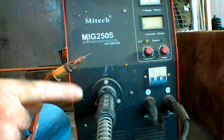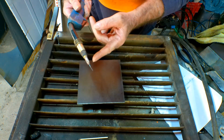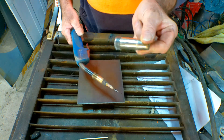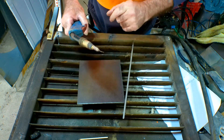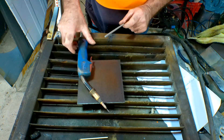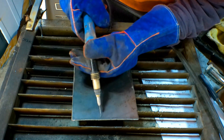We've got it set to electrode positive right now, so we'll do a bit of welding and I'll show you what that does. At the moment we've got the positive charge coming through the electrode — through our wire — and the negative coming through the earth clamp. We don't even need the gas shield since we're not using gas, so I'll just take that off so you can see a little bit better. Remember: the wire coming out of your MIG torch is the electrode. If they say electrode positive, you need the positive coming out of the wire. If electrode negative, you need the negative.